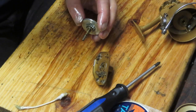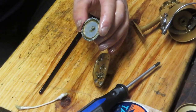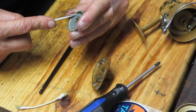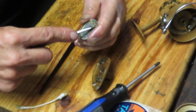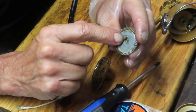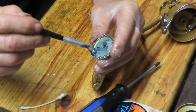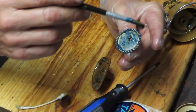We've cleaned up the back of the main gear — it's all about inspection and re-lubrication. Get some oil and grease onto the main shaft. On this side there's an accumulation of old grease — you can see it coming up in a chunk because it's dried and been thrown off by centrifugal force. Get rid of that — old grease won't help reel performance. Notice there's a copper flange here that goes over that stud. If your reel feels a little sloppy, make sure you've reinstalled that copper sleeve over the stud.